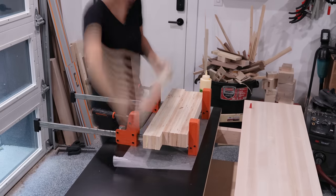They can also be used as a planing stop in this direction — just butt the work piece up against it and plane away. Now the gap stop in the middle is made so that it's completely flush so no pieces get caught along there. But sometimes you want a surface to butt up against quickly, like if you want to quickly plane something, or you can use it as a stop if you're cutting something. I have a pull saw, so I would hold it back here and then cut — the piece is being pulled against the gap stop and it's supporting it. If you have a push saw, you hold it the other way and cut that way. It falls right back into place.